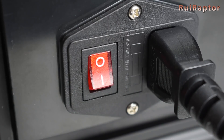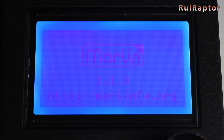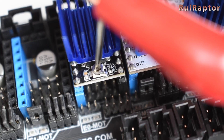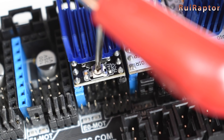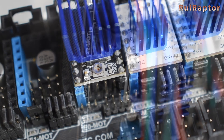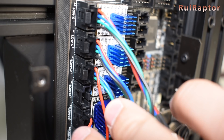Next, make sure it's ok to power on the printer and turn it on. Check if the display is working correctly and if you are reading the correct temperatures for the heat bed and the hotend. Check if the hotend fan and the driver cooling fan are turning, and proceed with adjusting the V-Refs for the LV8729. We don't need to adjust the V-Refs of the TMC 2130 because we will run them in SPI mode — the output current is defined in the firmware or by sending an M906 command. We will not go into the details of adjusting the V-Refs here because we have many other videos explaining this procedure step by step, so please check the video description for those links.